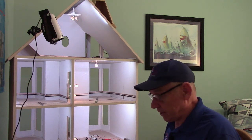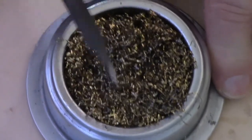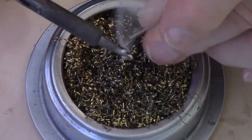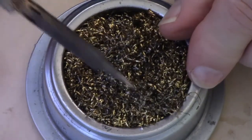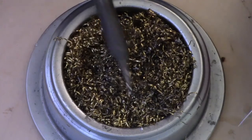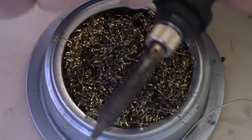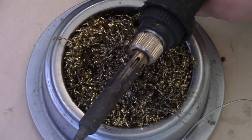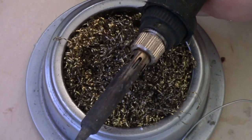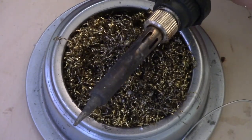As we're going to shut down, we want to clean the tip of the iron, put extra solder onto the tip, clean a little bit of that off, and make sure that we're clean and that it accepts solder on both sides. Then turn the iron off. After it has cooled, loosen the knurled knob a little bit so that it doesn't stay tight on there and prevent it from seizing up at a later date. Put this away until we're ready to start soldering again.